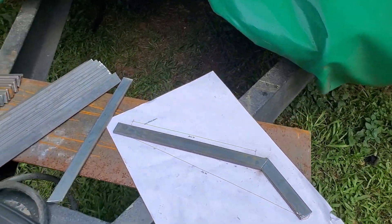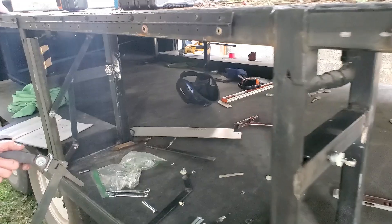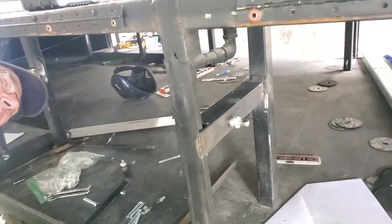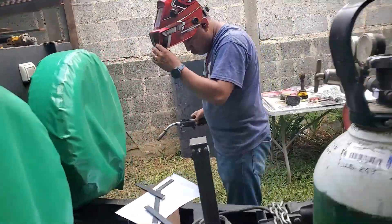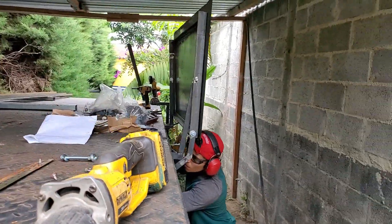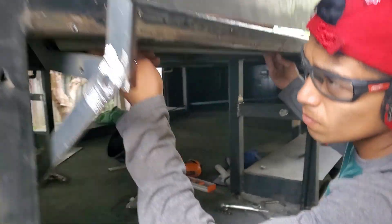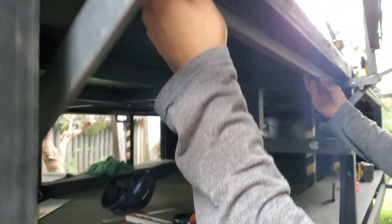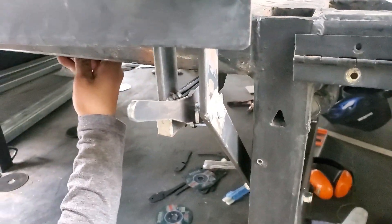We have the pieces going on here. On this side we've got the hinge going on — we had one hinge on, had a little adjustment to make, but got that back going again. On the other side, we've got this door all on and welded to it. It's got a little problem — it hangs down on this side. So we're going to put a stiffener between it, that's what Melvin's working on right now. We'll see if that solves the problem. It's staying open here — more cruising.